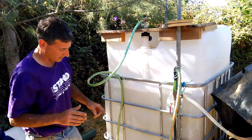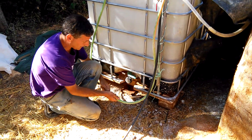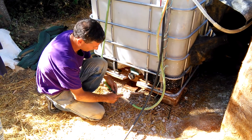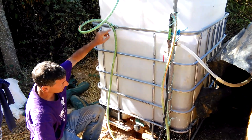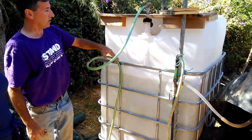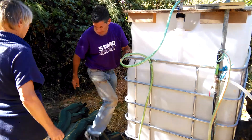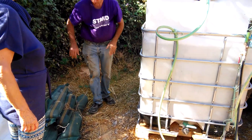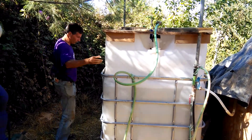You will probably find that there will be water accumulating in here and you'll try to turn on the stove and won't get any gas pressure. It could be that this has a little water — in that case, you just unplug it here, let it drain out, and plug it back in. You should be able to see the water. You can open it from either side. That's why this loop is tied here — so this is always the lowest point so you can see the water in there. This can continue to rise and fall because we have some slack here. Just coming around — you can see there are weights here. We found you don't need them; the sandbags are not necessary, but they're there. The weight of this board is enough to push it down. You saw the nice flame you had.